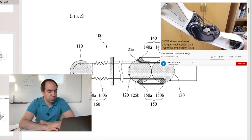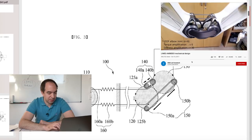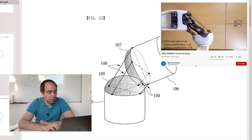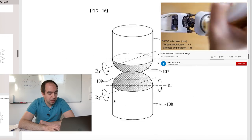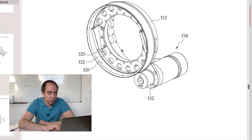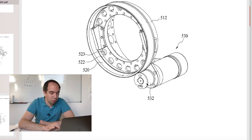For the elbow it uses a rolling joint — it basically moves like this. As you can see it's super complicated, with a lot of different pulleys. The wrist also uses a rolling joint. In the shoulder you can see there are four motors for the elbow and wrist, and this is the actuator used for the shoulder. In this actuator, this is the outrunner motor, this part is the planetary gearbox, and this is the final reduction stage made with a cable — a big pulley, a small one, and a cable between them. These three identical actuators are arranged with three axes perpendicular to each other.